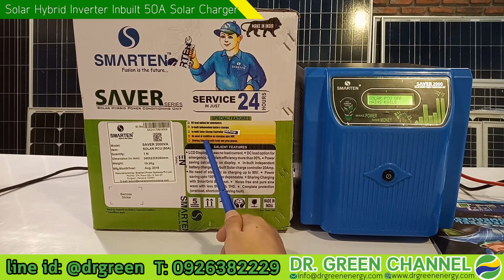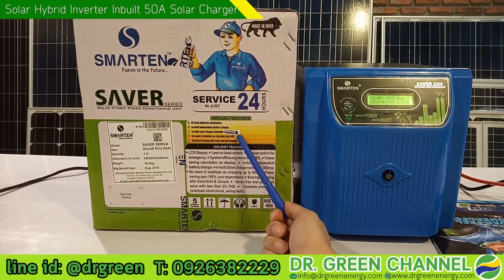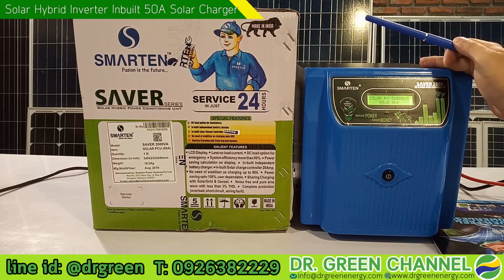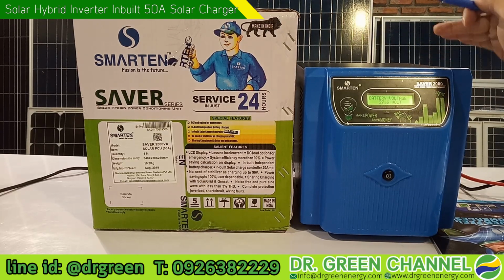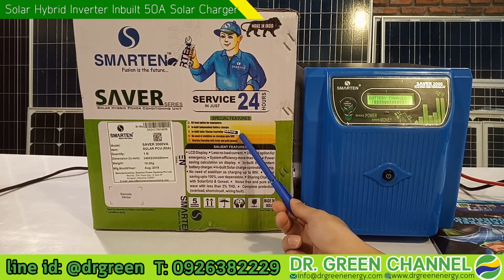No need for a stabilizer, as it charges down to 90 volts in the case the grid power or the mains supply from the grid is dropped. For example, in Thailand the supply is 220 volts, but the incoming drops to 90 volts. If it is working as a UPS, it still manages to charge the battery with this incoming voltage.